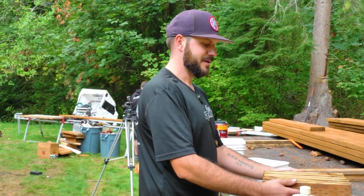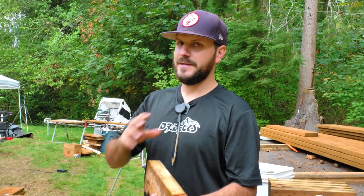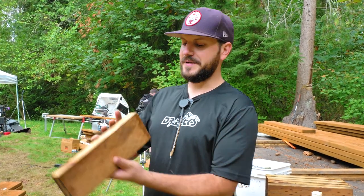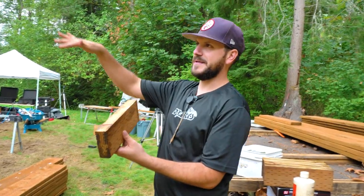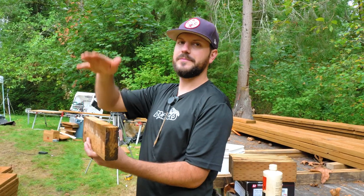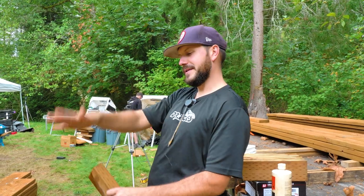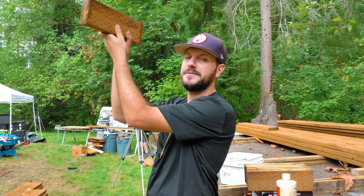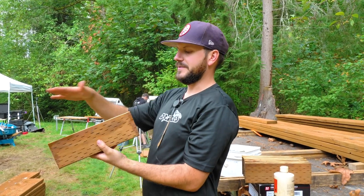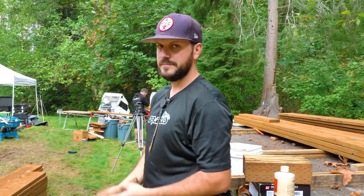Block man in his natural element! We got blocks here — measured them out and had Deck Wiz cut these guys. I had to rip a 2x10 down to make it into a 2x4 because this deck is being waterproofed with our EPDM bladder. The bladder sits between the joists in a U-shape, so you don't want to block up too high and constrict the flow. I ripped these down so they'll sit right on top — block tricks!